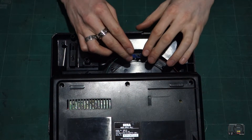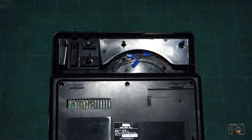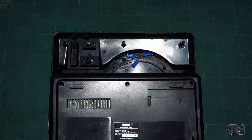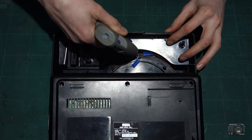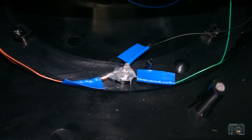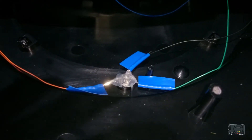Okay guys, we've got our LED seated in here. I'm just going to bend the legs down like so - that will help keep the LED in the right place. Now I'm just going to add a liberal amount of hot glue just to make sure it all stays nice and seated and isn't going to move around. So let's quickly get some hot glue in there, put it back together, and then we should be good to go. There we go - there's our LED seated nicely with the hot glue. So we're pretty much done. All we've got to do now is make sure the cables for our mods don't run across the cartridge port, put the Mega Drive back together and give it a final test.